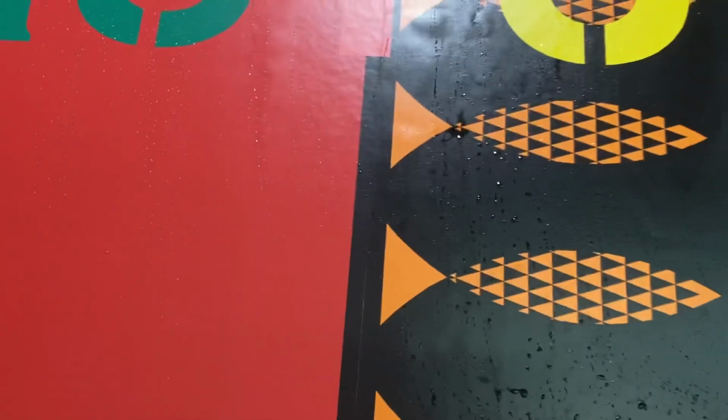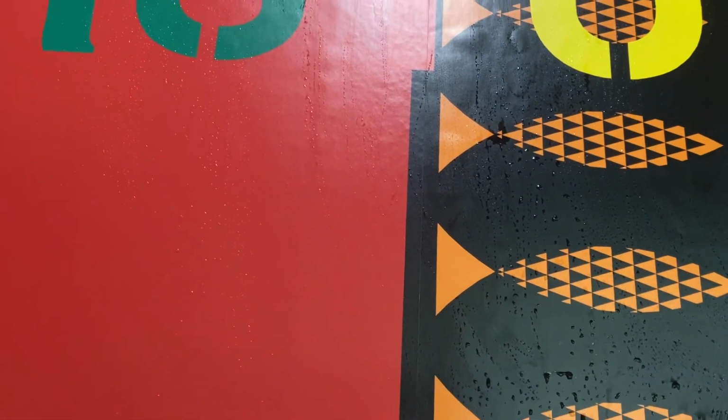Now, you may be saying, but Spencer, I can see the seam. But I say to you, watch this. After you get the moisture off of it, you can see that there's a bed of paste under it. You can see that will not be there when it evaporates. So if you just take your hand and push it together, you'll see that that seam will disappear. And that's how you work it. You nurse that seam and you make that disappear. Look at this one. This is the same seam. You get the point. You're perfecting the seam, and you'll do that by not over manipulating it.